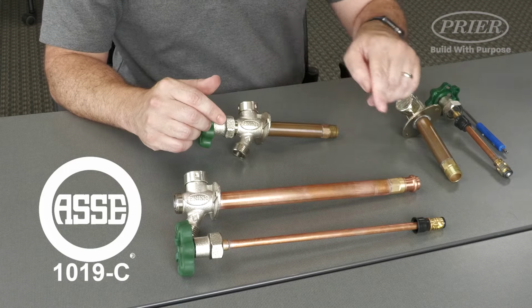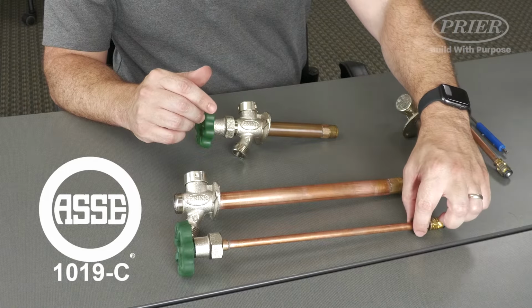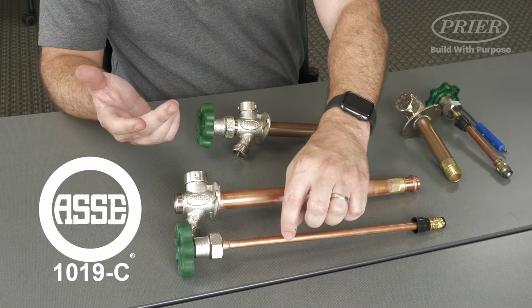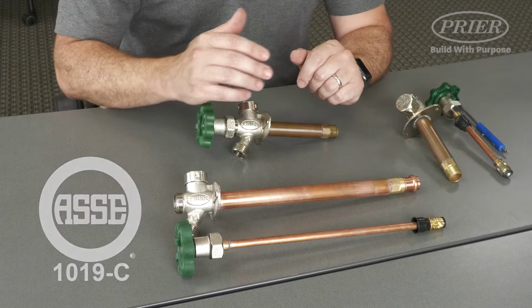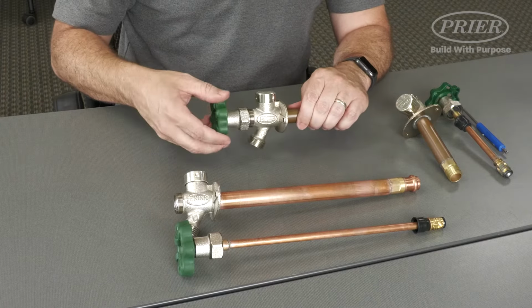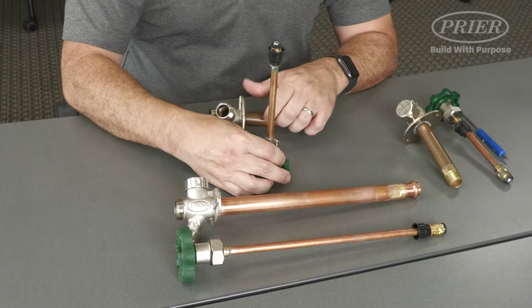Our backflow preventer works as a boot that allows the water to flow over during the operation, and in the case of a backflow, that water trying to go back would get encapsulated into the boot itself. During removal, you may find that the stem is actually not orientated correctly.